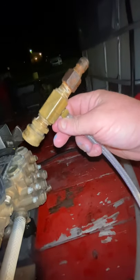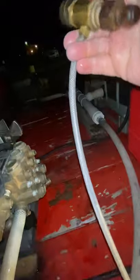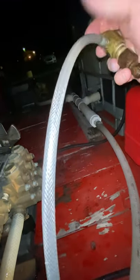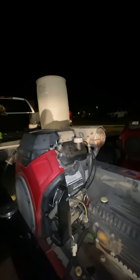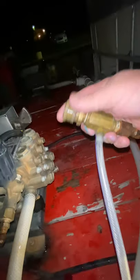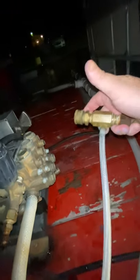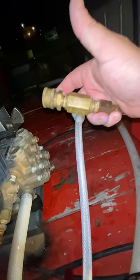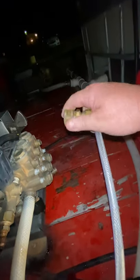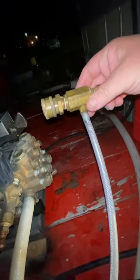So this is a downstream injector, and it's got a very long hose — this one's about 10 feet — and it actually goes to my SH drum. SH means sodium hypochlorite. Sodium hypochlorite is a bleach solution, basically like household bleach, but we use 12.5%, which is about two times stronger than your regular Walmart bleach. Walmart bleach won't cut it — stronger is better.